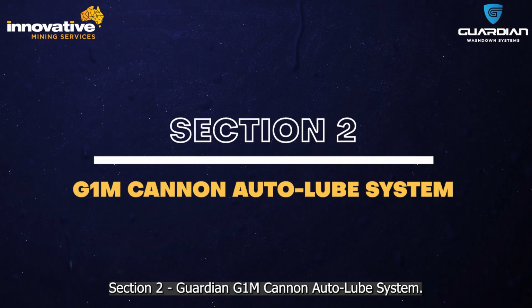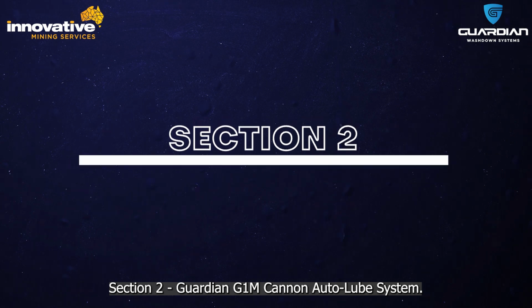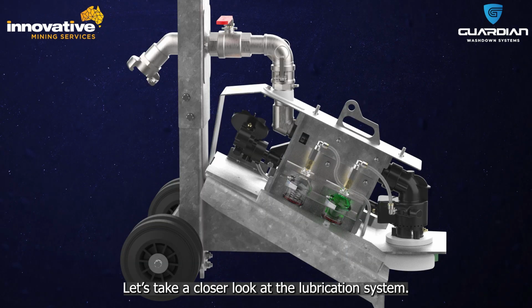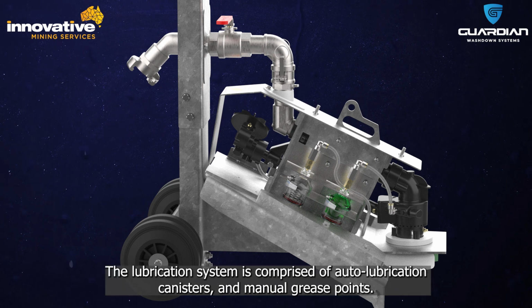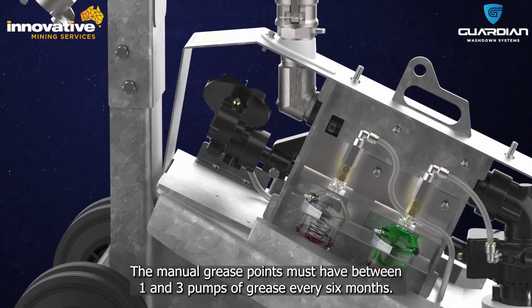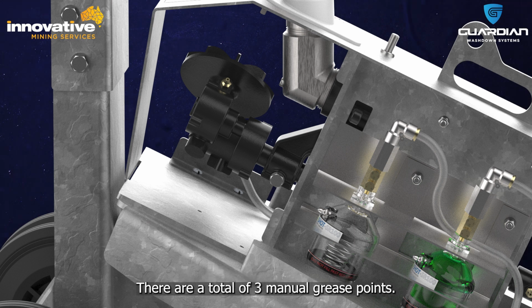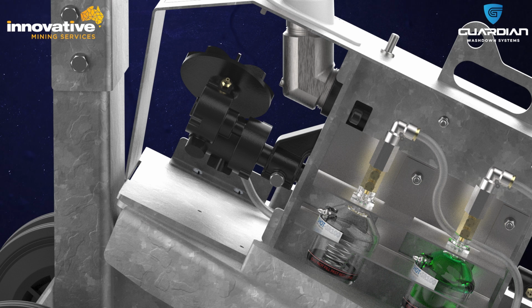Section 2. Guardian G1M Cannon Auto-Lube System. Let's take a closer look at the lubrication system. The lubrication system is comprised of auto-lubrication canisters and manual grease points. The manual grease points must have between 1 and 3 pumps of grease every 6 months.